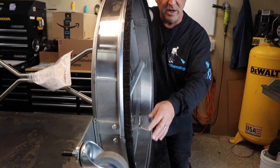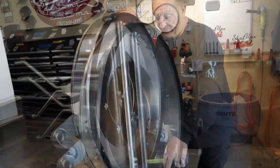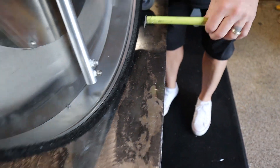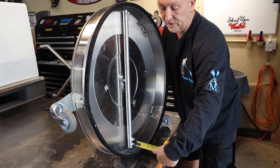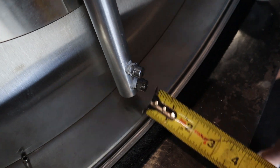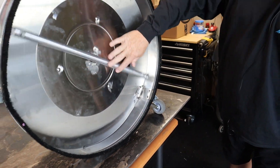So what we do is raise it up a half an inch so it's not hitting the deck. As you can see, it's nice and smooth and not hitting anything. When we raise it up, instead of about a half an inch off the ground, now you have an inch and a half off the ground. As you can see right here on the tape measure to the bottom of the bristle, that's an inch and a half — whereas before it was only a half an inch and the tip was literally right down there.